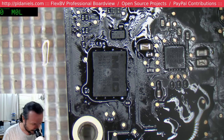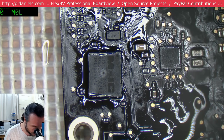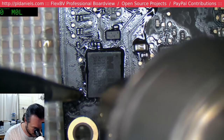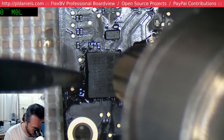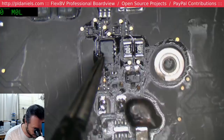Come on, heat up. Normally I wouldn't bother taking these balls off the edge of the BIOS, but it's a little bit out of alignment, and because I had the large amount of solder underneath, I kind of want it to rest back into a more natural position again. Oh, it's cooled down fast. Okay, that's fine. Okay, our 3V42 area is a complete disaster, which is an understatement of the day. Looks like they've shifted that as well.